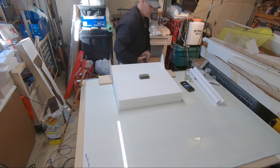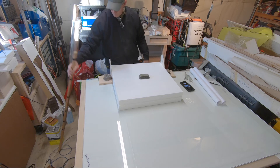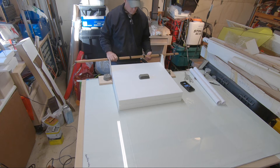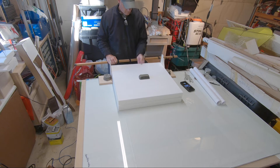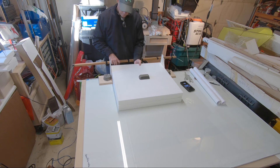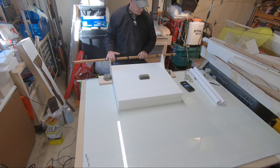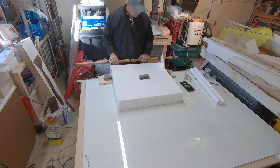These little half-core blanks I'm slabbing out — I just set them up so I've got the blanks at two inches thick. At this point I'm actually getting the true edge on the blanks. You've got to start with one edge. This isn't critical as far as where you place it, but what is critical on this cut is that it's 90 degrees. So this bow is on a variac.